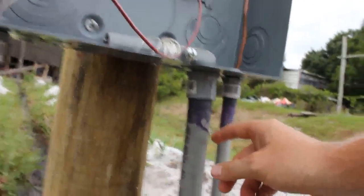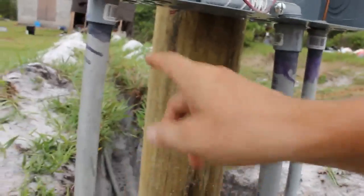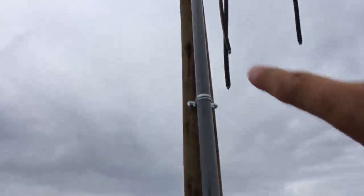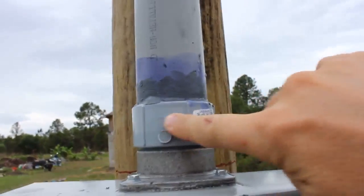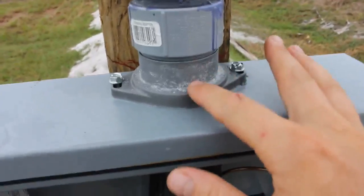I couldn't find a half-inch metal screw, so that might be an issue — we'll see what the inspector says. I used gray electrical PVC primer and glue, so all the pipes are primed and glued together. I used two clamps on the two-inch pipe. You need a weatherhead on the top of the two-inch PVC pipe. These are all standard parts you can get at Home Depot. You need the coupling at the end — this piece and that piece you buy separately, and the rest is just PVC pipe with two couplings.